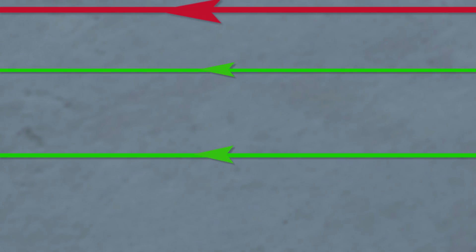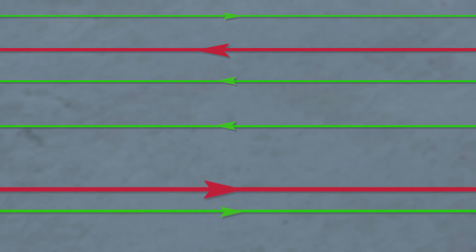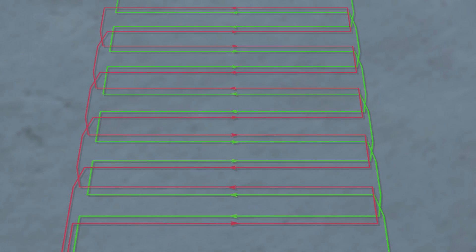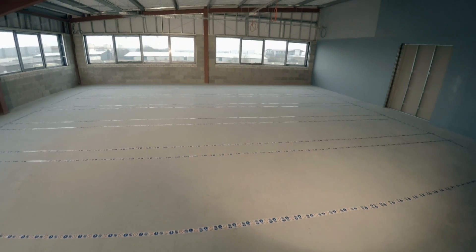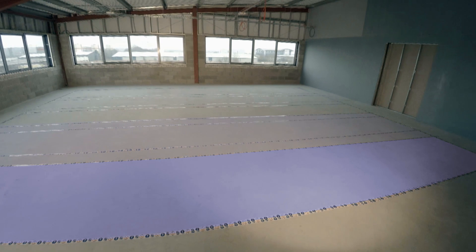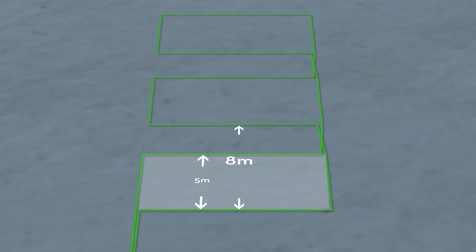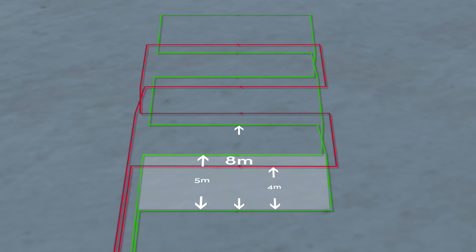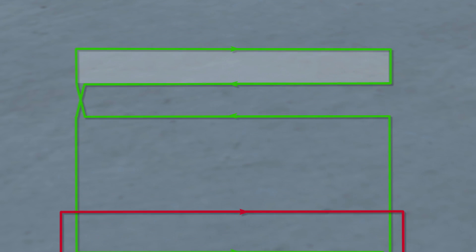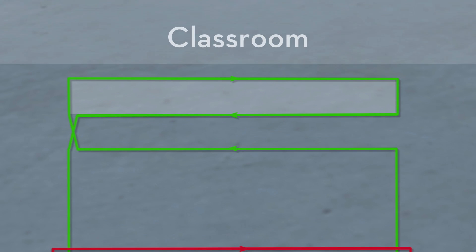In this simplified low spill array the pattern doesn't change even when dealing with larger areas — you could have 6 greens and 5 reds depending on the size of the room. If we were to transfer this into a sports hall for example, this 2 metre section might be 5 metres, which is the largest rectangle we'll use. You could have a 5 metre rectangle with an 8 metre spacing between them and then an offset of 4 metres, which is obviously half of the 8 metre reading. It is also possible to add a smaller 1 metre loop at the end to create a very low spill system if, for example, you have classrooms very close to the wall.